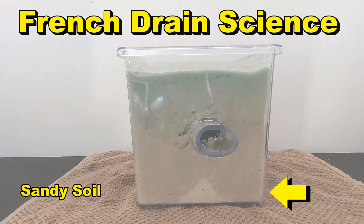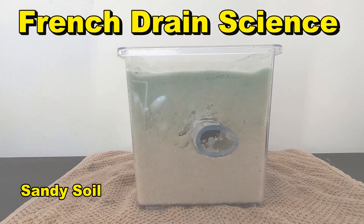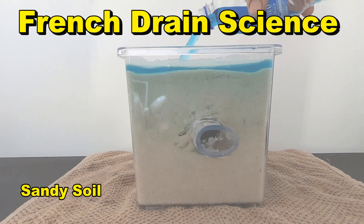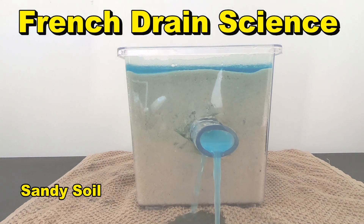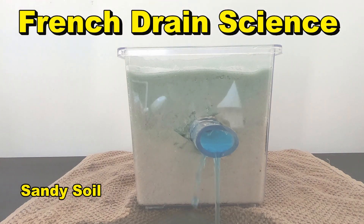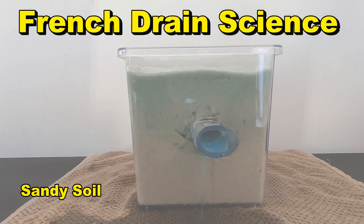About another hour later, here comes another huge event rainfall — a big one, this one's really got the water coming down. Watch what happens when we add more water to the saturated soil. As the ground fills with water, that's when the French drain begins to work. And although it looks like the water's coming from the top, it's not — it's actually coming from the bottom. As that groundwater rises up and becomes so full, it begins to push itself through that gravel into the pipe and is carried away.